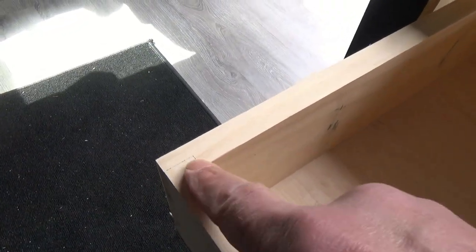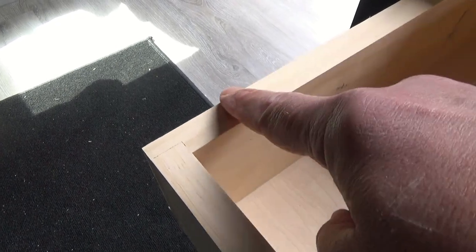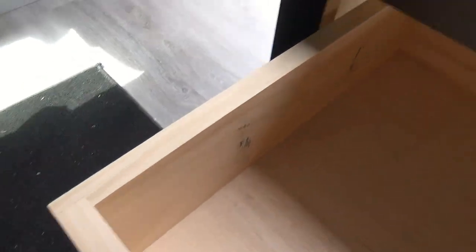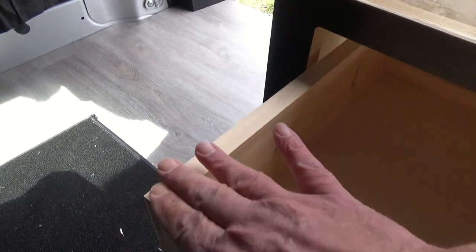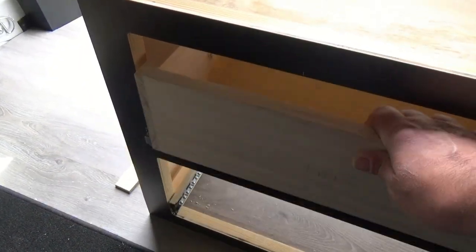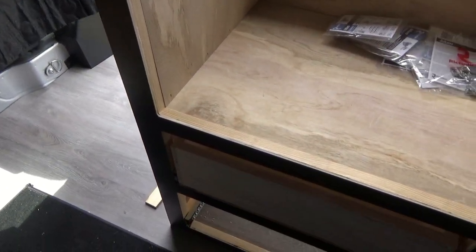For the front and side of our drawers, we're going to make a rabbet in the side pieces. This is the 18-inch piece and we're going to cut a rabbet, 3/8 by 3/4 inches, in both ends of the drawer side. That way our front and back piece can sit in there, and then we can attach it — put some screws in on the side and that'll hold it in place. Let's get the saw set up for our rabbets.